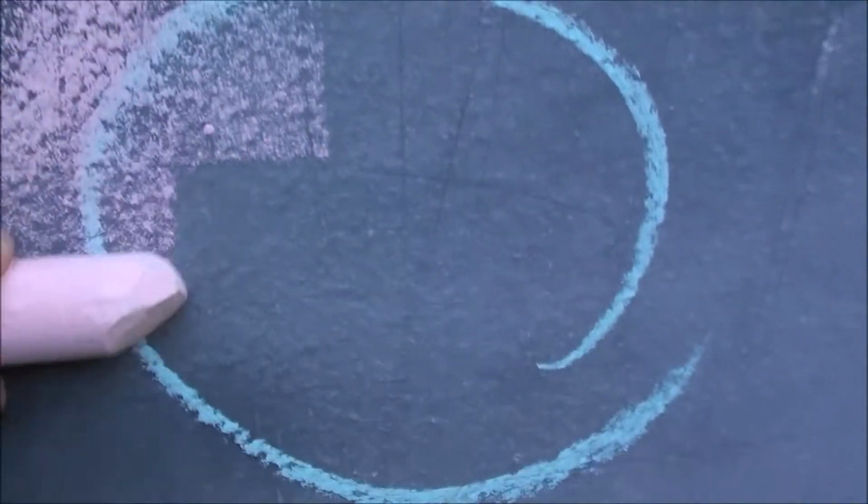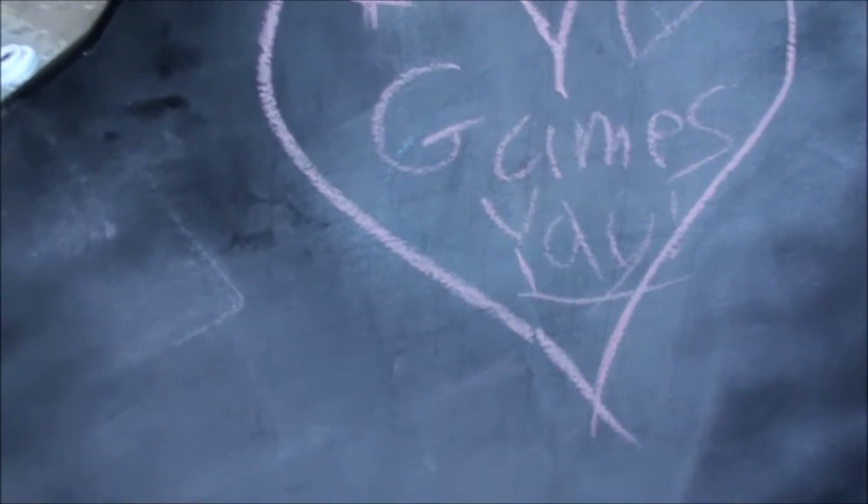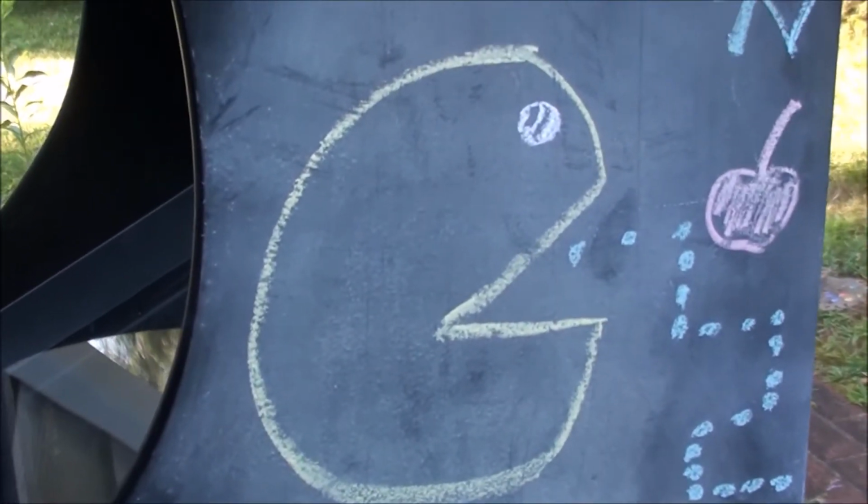So just let it set for 2 days, and then you go back, and let me show you what you do. They call it seasoning the chalkboard, and to season the chalkboard, this is what you do. You take the chalk like this, and you go like that all over the chalkboard, and then you do the other way, like that. So you basically are filling all the little holes with chalk dust, and then you just come back and erase it. When I was reading about it, it said if you don't do that, then when you mark, you won't really be able to erase it very well in the beginning. So it gives it kind of a gray, chalky color, which I actually like, because you've got the black T molding and the black front, and it just pops. It makes it very clear this is a chalkboard.